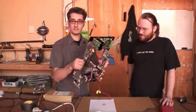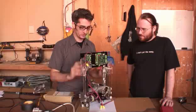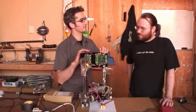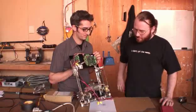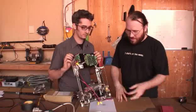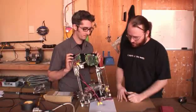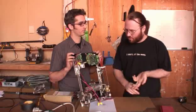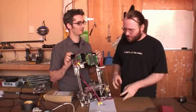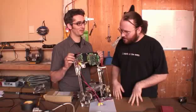When we first picked this thing up, it was just a skeleton and muscles — by that I mean there was a chassis and the motors. There were no electronics. We started off by determining what we had, which was basically three stepper motors and four limit switches. We had to figure out how to read from the limit switches and control the motors. What you see here is the result of a bunch of breadboard test versions that we wired up. This is our final cabling. It's not always looked this pretty.